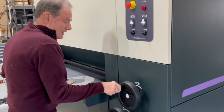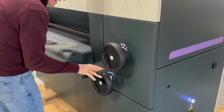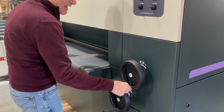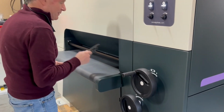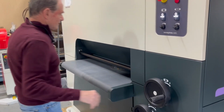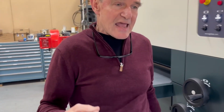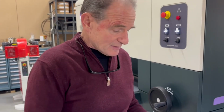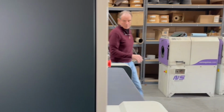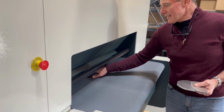As I said, we're going to lighten this up a little bit, and we're going to go to 1.5. So here we start to hit with the belt at about 1/8 of an inch, but we're going to go down to 1.5, because you simply can't have that grinding belt pressure on the part like you can have with thicker material. Here we come now. I can see the white line already. You will be very happy.